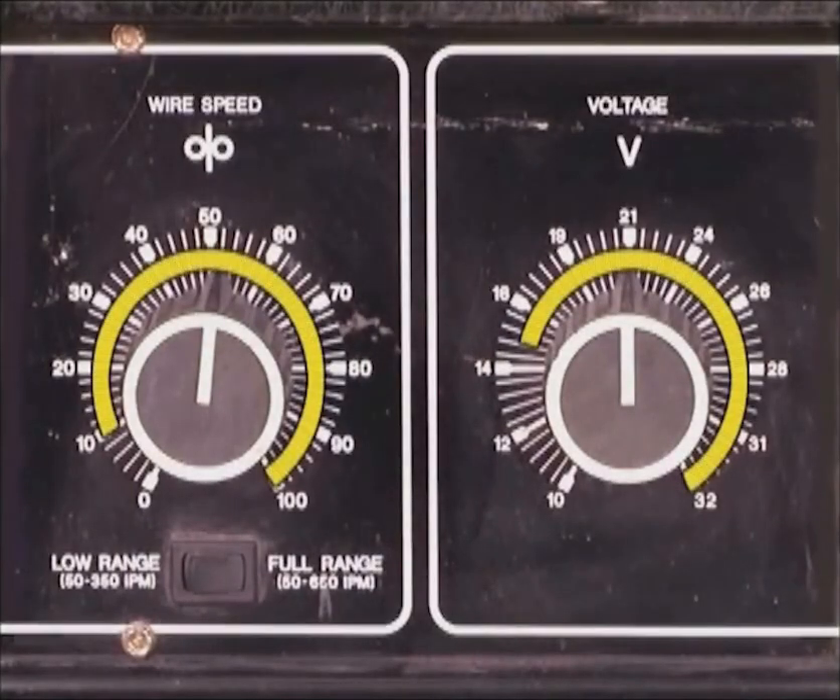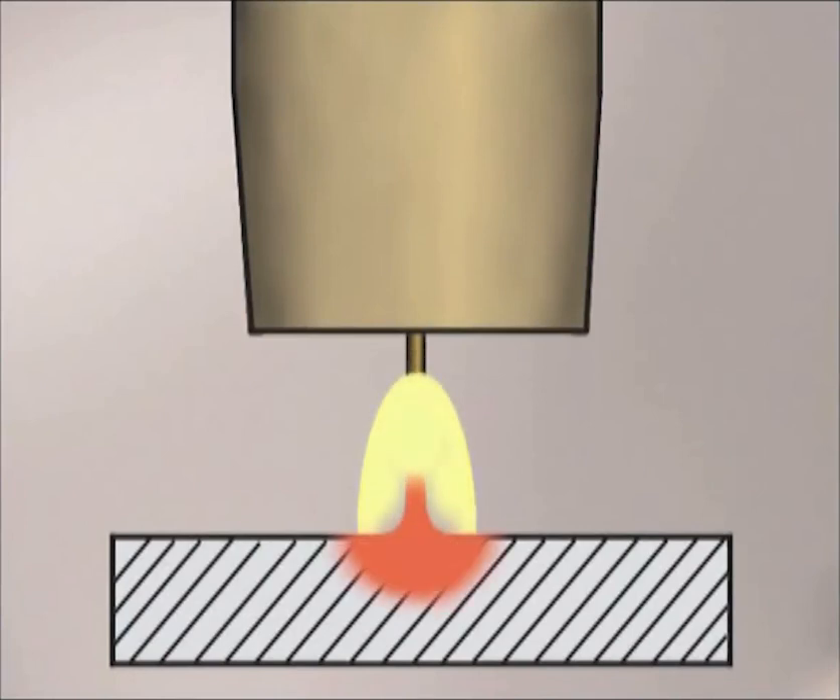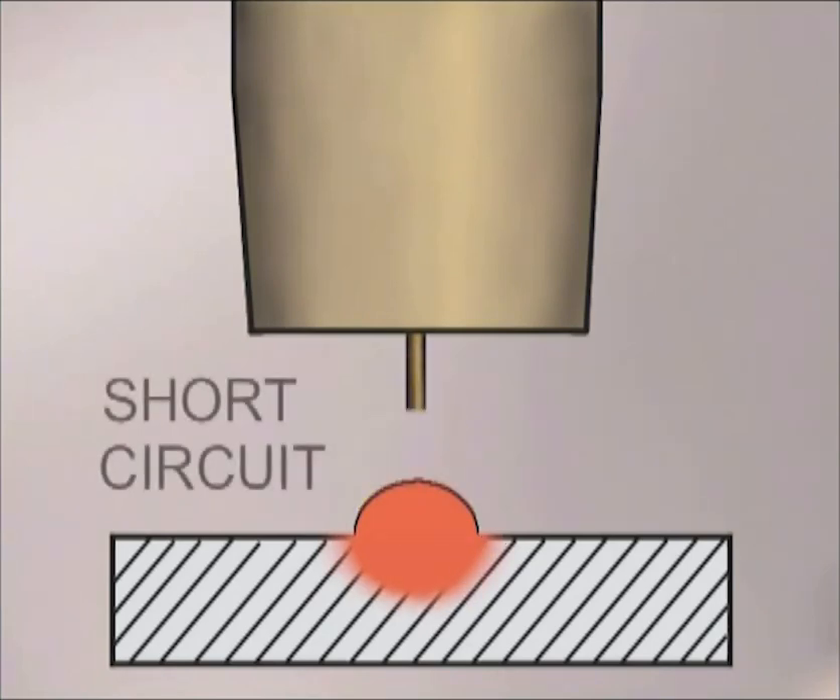One of the unique characteristics of wire feed welding is that if you want more weld deposit or more heat for better weld fusion, you simply turn the machine up. Each of these wires will operate over a wide range of voltage and wire speed settings. Throughout these ranges, the filler metal is transferred differently. At the lower voltage range, when the wire makes contact with the base metal, current causes the tip of the wire to heat up until it pinches off and arcs. The hot gases surrounding the arc melt the filler and the base metal, fusing them together. The continuously fed wire then overcomes the heat of the arc and contacts the metal again, heating it up, pinching it off, arcing and fusing. This is called short circuit transfer and the cycle happens 50 to 200 times a second.